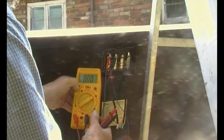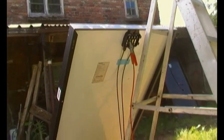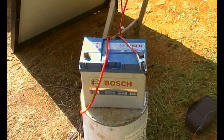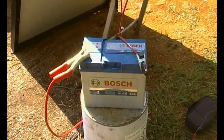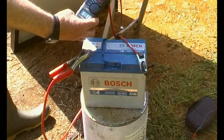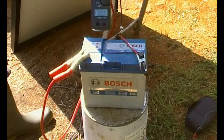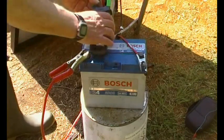So let's try the other one — this is an as-new Sharp panel. The sun's coming out and we've got the same sort of thing; we're taking power from two sets of wafers. That tells you a lot straight away, if you heard that crackling. We just want the clamp meter reading: 7, 8 — 8.7 amps. So that gives you a good idea of the difference.